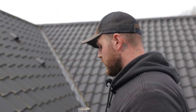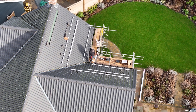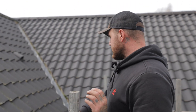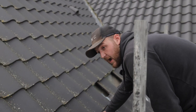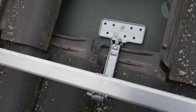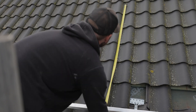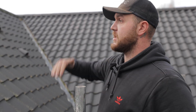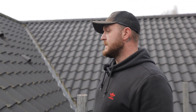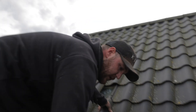What we've got is all the roof hooks going in — two fixings per hook, on the rafter, not the batten. You sit the bottom of the hook on top of the tile. From there it's just a case of getting the rail into these hooks, making sure they're located and clicking it in. Once that's done, I can use this as a step up to get my next rail in. I run a measurement up, then I know which tile to take out and follow the same bracket pattern. Once we've done that, we jump on and do the next two up.